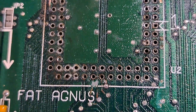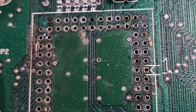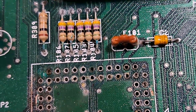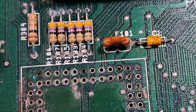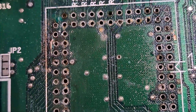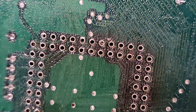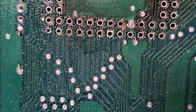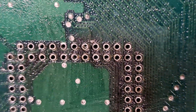As you can see there's a little bit of damage to the board there - some broken tracks - and if I go up you can see there is corrosion around the bottom of those resistors there as well. Definitely some sort of water damage has gone on. The board also got a little bit burnt when I was trying to take it off.